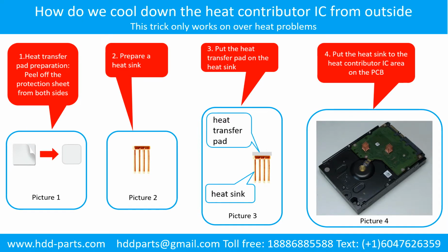How do we cool down the heat contributor IC from the outside? Step 1. Heat transfer pad preparation. Peel off the protection sheet from both sides of the heat transfer pad, like the picture 1 shows. Step 2. Prepare a heat sink, like the picture 2 shows. Step 3. Put the heat transfer pad onto the heat sink, like the picture 3 shows. Step 4. Put the heat sink to the heat contributor IC area on the PCB, like the picture 4 shows.